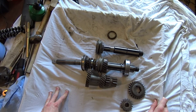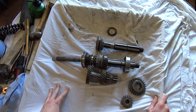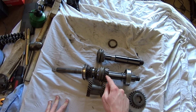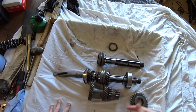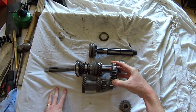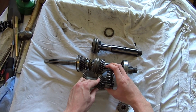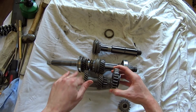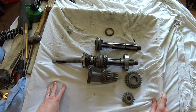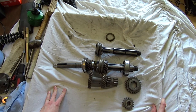So in summary — in third gear: clutch in, to neutral, clutch out, blip the throttle to speed everything up, clutch in again, down into second, clutch out, power on and away we go. That's double-declutching. The synchro has to do far less work because instead of using it to match the speeds you're blipping the throttle and powering it up yourself. You can even double-declutch on gearboxes without a synchro at all — blip the throttle to match the gear speeds yourself and you avoid the grinding completely.